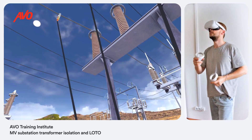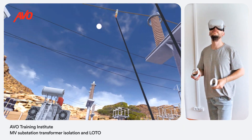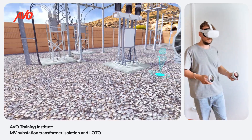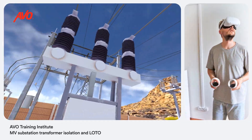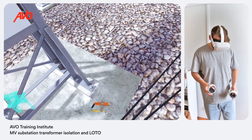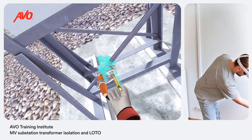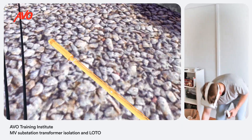Repeat the operation and apply PPGs to feeding ACSR conductors from the load side of the transformer to the line side of the vacuum breaker. Using a hot stick and rubber gloves, attach a grounded lead to each of the phases.